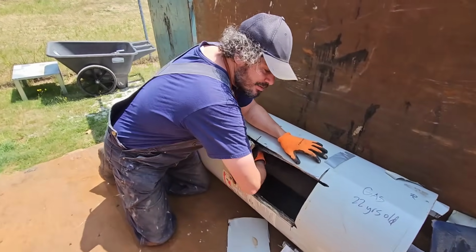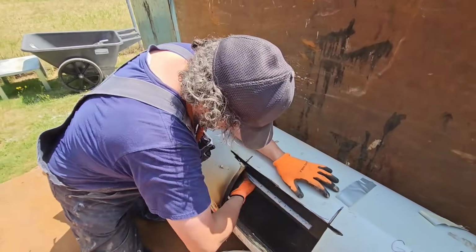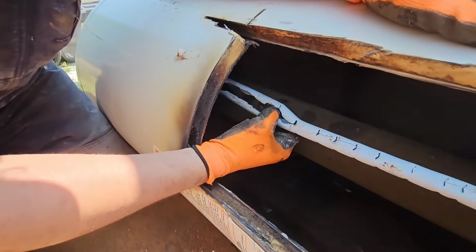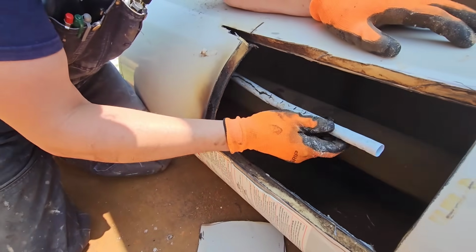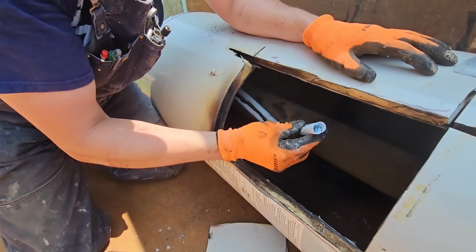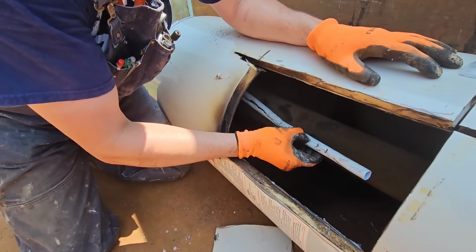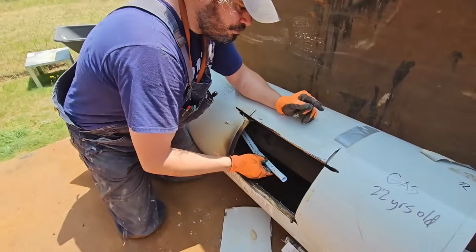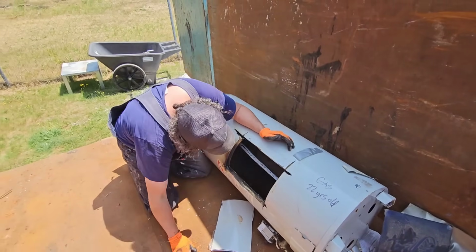This dip tube has completely lost its integrity. This crack, I can fill it all the way up. Oh, dang. Yep. So at some point in time, this thing is just starting to deteriorate. That's kind of a problem too, because all this stuff gets up into your water and just clogs the crap out of everything. That's one thing I would really like to ask Bradford White to do is, can you do something better than this chintzy plastic, please? Right. But you are keeping our Future Plumbers of America employed, so there's that.